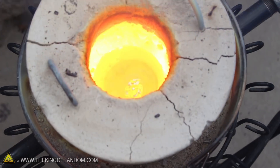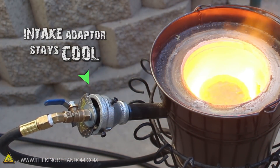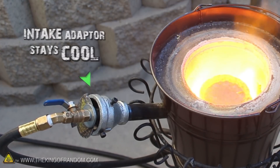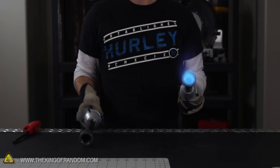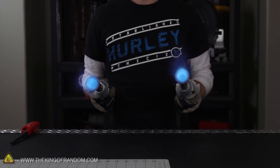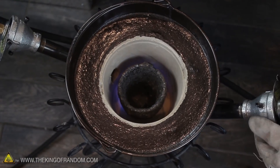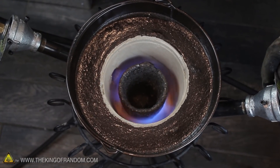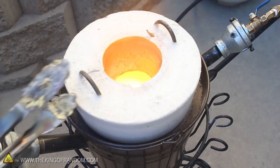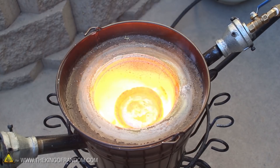The inside of the foundry gets hot enough to boil brass and liquefy bullet casings on contact. But amazingly, the intake end of the torch stays relatively cool the entire time. If one jet torch can do all that, why not exponentialize the power by adding another? I added a T-fitting to my hose so I could split it and run separate lines to each torch, then drilled a second hole through the side of my foundry so now the flames hit the crucible from either side. Try it for yourself and you'll be amazed at how fast this flaming duo can really heat things up.